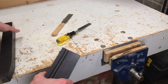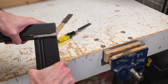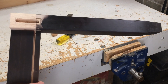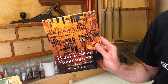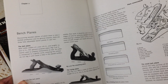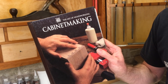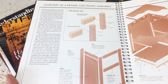I'm now ready to test out the tenon in the mortise to see how well this fits. The joint surfaces you're looking for — you want them to be tight, but not so tight that they're going to split the mortise, just tight enough that they'll hold together on their own. You can see how well this piece has come together. It's all ready for the glue up. There are two books that have helped me learn these skills over the years: the first is Hand Tools for Woodworkers, which has good insights into how traditional tools work and how to sharpen them. The other is Cabinet Making — it's an older book, but one I've used over the decades to look at the details of how things are built and learn proper joinery techniques. I'll leave a link to these books in the video description.